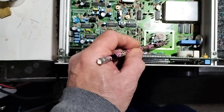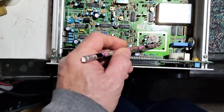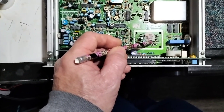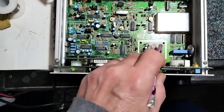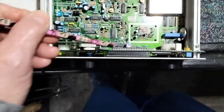I have a sneaky feeling the J310 FET could be faulty, but trying to get good J310s these days is like finding a needle in a haystack — most of them are fakes. There is a surface-mount one available with a small adapter, but that's going to add extra capacitance into this particularly sensitive local oscillator circuit. So I'd rather get a genuine J310.